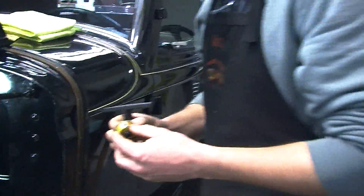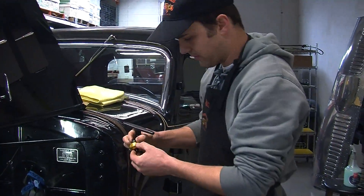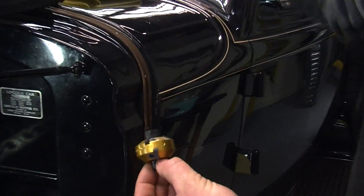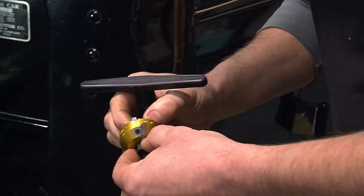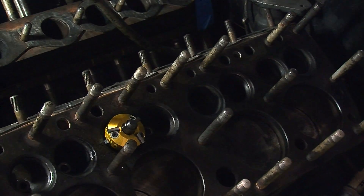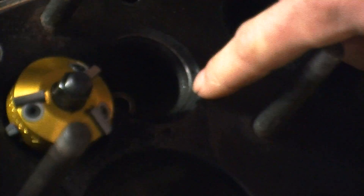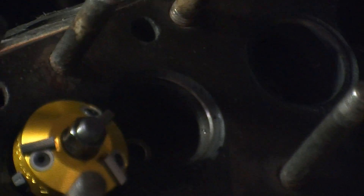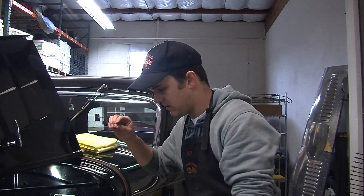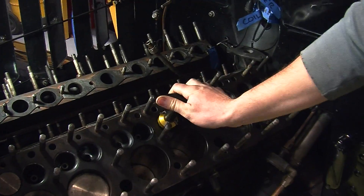The important thing is your seats and the angles you're cutting them. You've got different angles here: I've got a 30-degree angle, I've got a 45, and other angles in my cutter. You're cutting it to flow the most amount of air past the valve. On these cast iron seats, you're also looking to make a fairly fat and wide seat, because otherwise you get a lot of seat recession and real high pressures, and your soft seats end up going away on you.